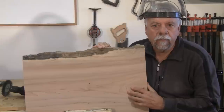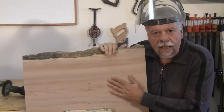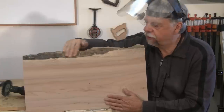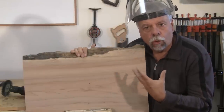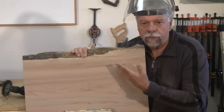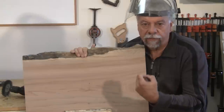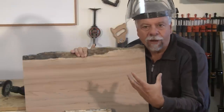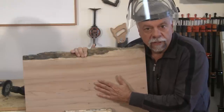I actually kept going and discovered that I liked that finish — those little micro grooves along the edge of the live grain. Later I found that other people had discovered the same thing. You need to be very careful with wire brush utilities: wear excellent eye protection because the little wires come off and you're also spewing out wood products. I prefer to do this outside. For this demonstration I'm using a corded drill, which gives better sustained power than a cordless drill.